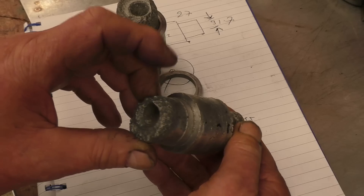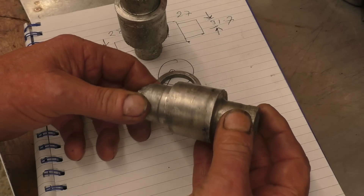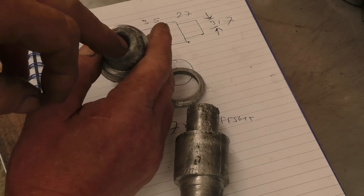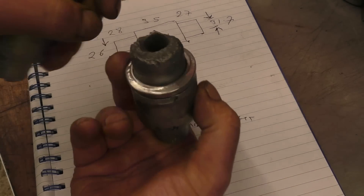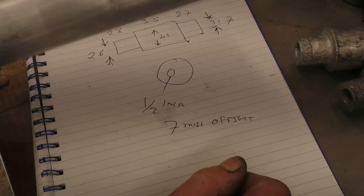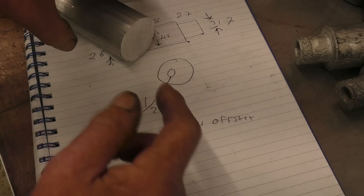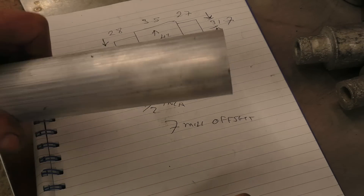These pieces of badly chewed aluminium are actually engine mounts of an old outboard motor. I've got to make two of them. I've taken as many measurements as I possibly can from them, averaged out what they are, and I've done a little drawing. There's also an offset — that hole in the end is offset, must be on a cam to tighten something up. Everything I've drawn is in metric except that hole, which needs to be reamed half inch. I've got some aluminium bar. I'm going to cut two pieces to length first, about 100mm long, then put the four-jaw chuck on and do the offset hole first. Then I can machine it in a three-jaw chuck, one side and turn it over to the other side. Anyway, that's the plan.